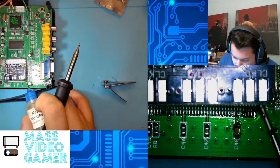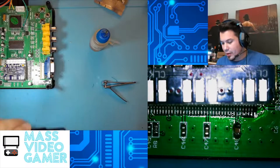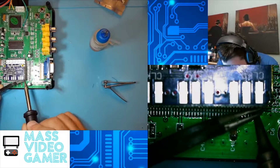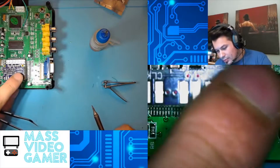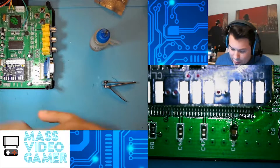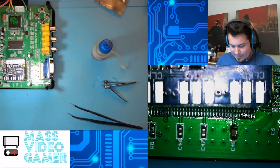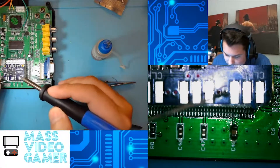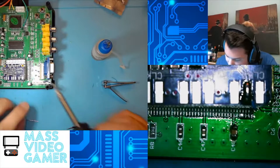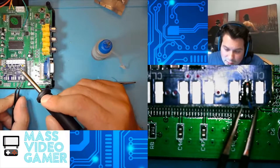We are going to be cleaning it with isopropyl afterwards, so make sure to use flux on this. I'm using 60-40 solder and my tip is a little low on heat — we're going to put it at 300°C. The reason why is because we don't want to burn any pads or anything. I'm going to go ahead and solder this to the IC itself, to the actual IC leg, using 30 gauge Kynar wire. We'll fold it up and around with our tweezers and get it to the middle of the clock zero pad. I'm going to go ahead and fill that pad with solder to prepare for the wire, then heat up that blob of solder and put that wire right in its place.